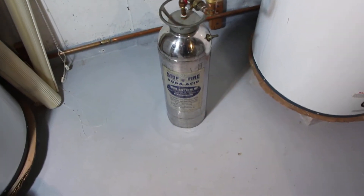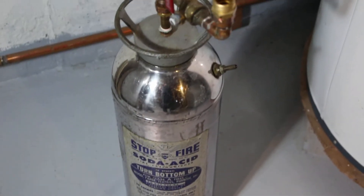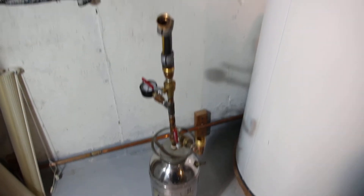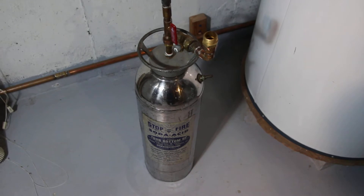Okay, second tip is how I charge the system with antifreeze. The first thing you do is you can use a pump of some kind to get fluid into the system. But if you want to add pressure to it, usually a pump won't do it necessarily. So what I use to top off a system is this thing — it's actually an old-fashioned soda acid fire extinguisher, modified with all kinds of fun stuff so that you can add pressure to a system.